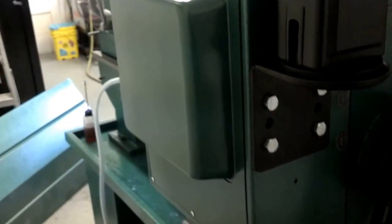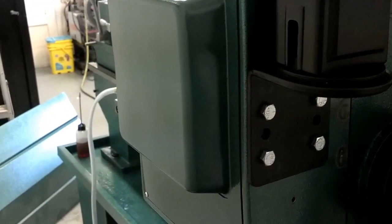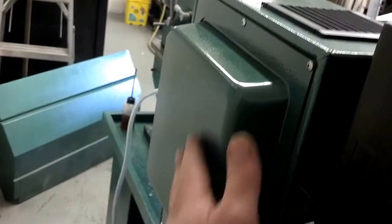The original electrical cabinet — I got it out, put a VFD in there, cooling fan. I had to modify the cover with a cake pan to give myself some extra clearance. The electrical cabinet houses both the servo drives, the ethernet smooth stepper and breakout board power supply, and then the big toroid power supply for the servo drives.